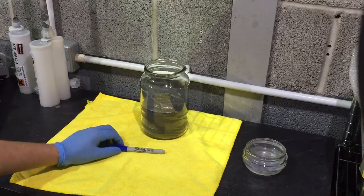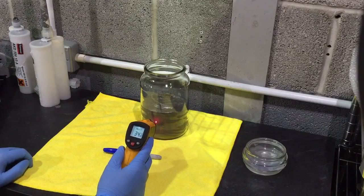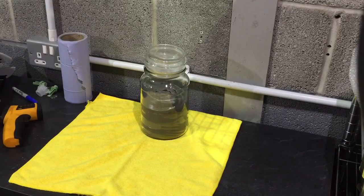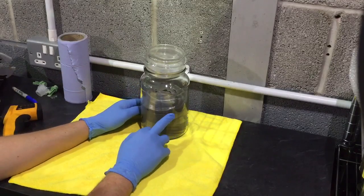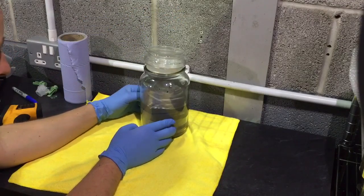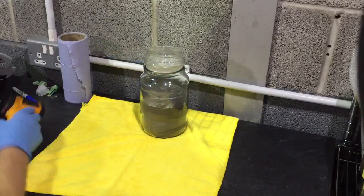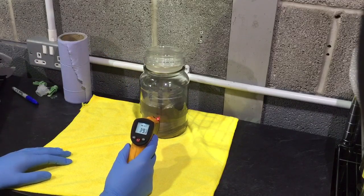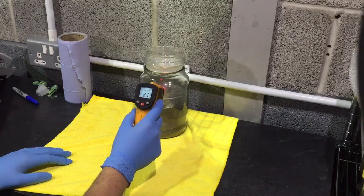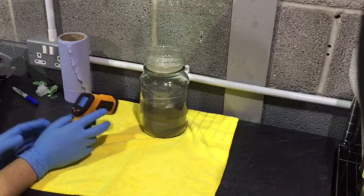Just for recording purposes, we've put a sharpie line round the tideline at the point of installation. It's just gone in about just over a minute ago, and we're checking the temperature of installation — it's about 34 degrees C. We're about four minutes in and we've got expansion already. It's hard to see, but the line is just under my finger. If we turn this around, it's levelled out and expanded quite well where the trough was. Quite warm to the touch, and temperature-wise we're up to 39 degrees — definitely going up.